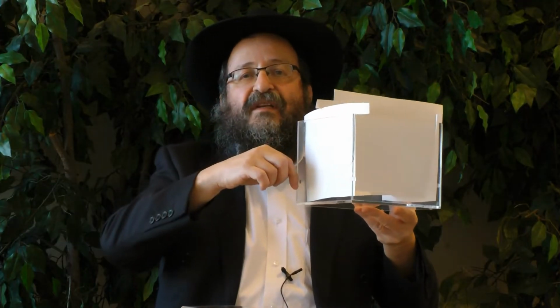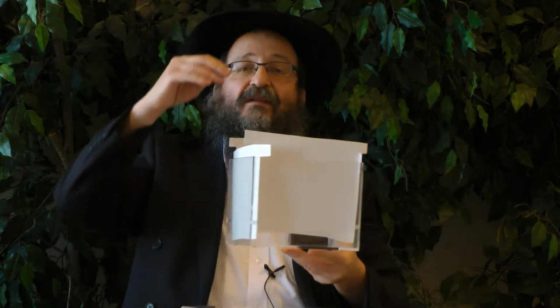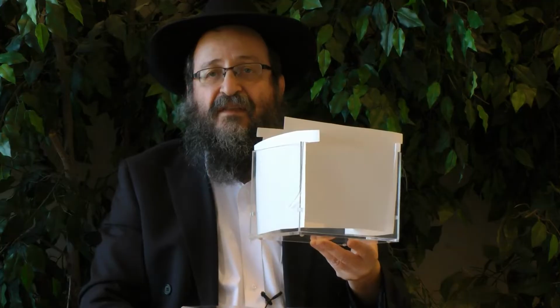The rebar is sitting there. You tie it in, make sure that it doesn't move. You have to be careful that it doesn't move in, that it should come all the way in. And you pour your cement. Some people like to start off from the middle and then build up the sides. Some people will go from the sides and it flows underneath, and so on.